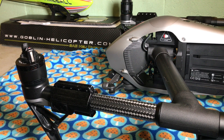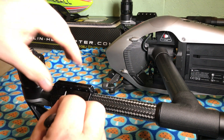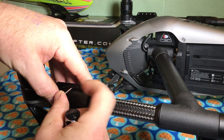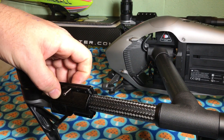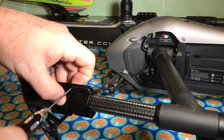I haven't received my new bolts in yet, so I'm using some that are a little too long, but they'll work for this demonstration. What I would do is start in the middle and clamp it down a little, then move down to the bottom and do the same. I'll just put my finger over top of the nut so it doesn't get pushed out when you're tightening it down.